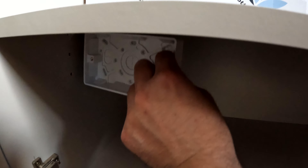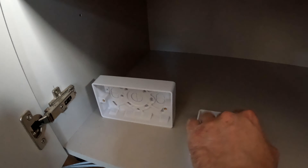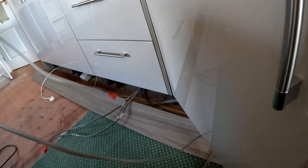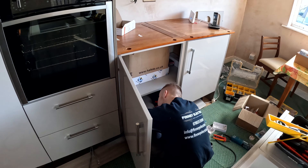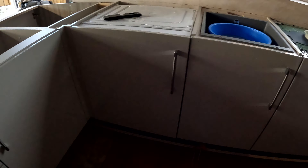In the back of here there'll be a little socket arrangement set up towards the back. We've got a little 74mm cut-out underneath so the plug tops can come through and we can plug in the microwave. Next to that, we've brought in a 20-amp feed here that goes back to the fuse board, 20-amp rated, and we'll bring that up into a single one — that'll have a 20-amp switch and will do this oven.